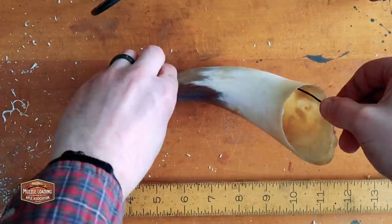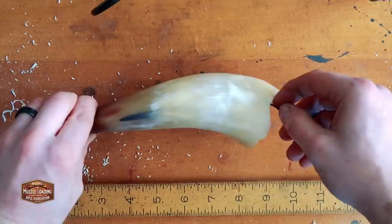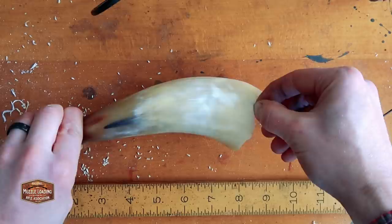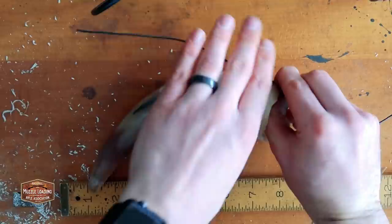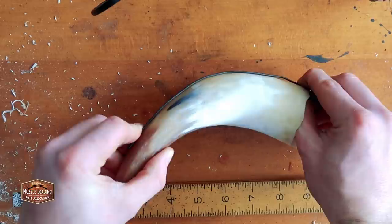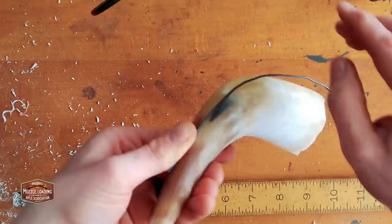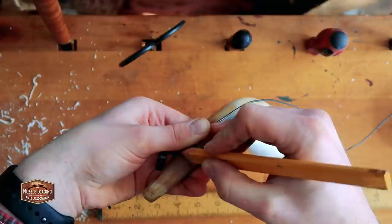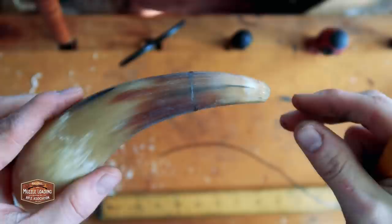I'm going to bend the wire a little bit in the shape of the horn and run it in, pressing the wire so it runs up against the back wall of the horn. The rear end of my horn is pretty thin and broken up so I'm grabbing the wire where the horn is shortest to work with a safe length. I pull that out and line the wire up to get a visual idea of where the cavity stops — that's a direct inside-to-outside measurement. I grab my pencil and mark where the end of that wire is. It's a lot farther up in there than I thought, and I continue the line all the way around.